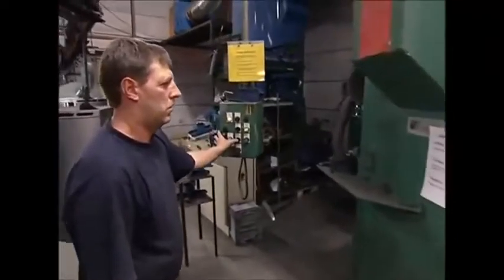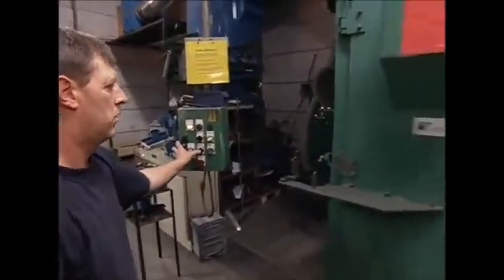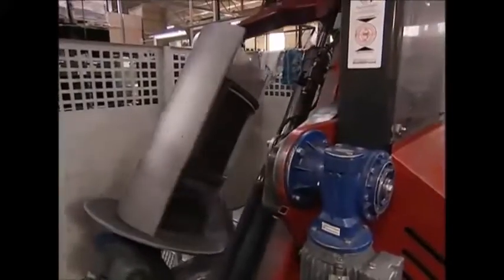It's time for some cosmetic work. In this chamber, thousands of tiny steel balls are blasted around the stove for 15 minutes to give it a textured finish. The hoist lifts the stove from the chamber, and then the steel balls are tipped out.